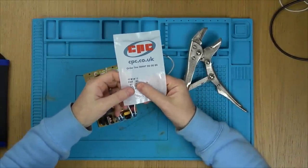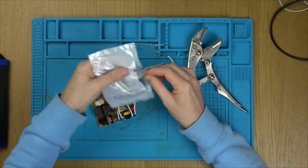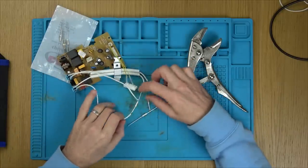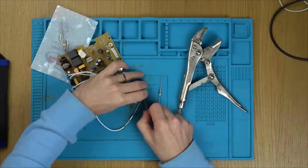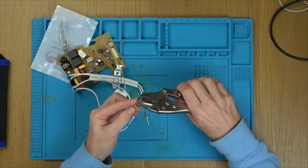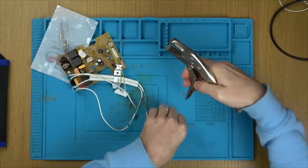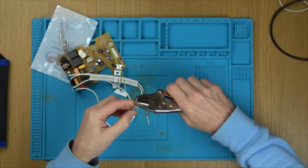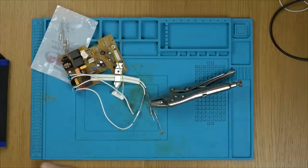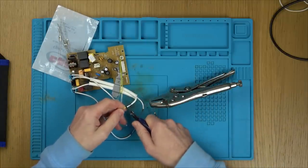A few days have passed and my little thermal fuses have arrived. The CPC item number is FF03012. I'm not sure how many I'm going to get through trying to solder these on, because the soldering is going to be way hotter than what these can handle. So if the heat gets in, they're just going to burn out. I've got my mole grips here - if I do that along there, the heat will be more tempted to travel down into these, acting as a heat sink, so I'm hoping I'll be able to solder it on without this burning out. I've done it before on the coffee maker.